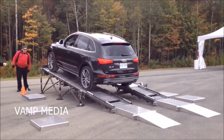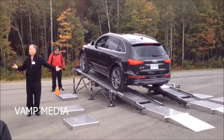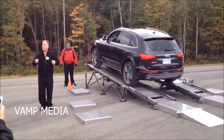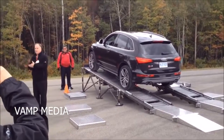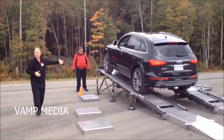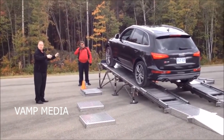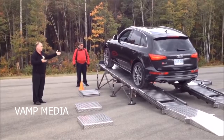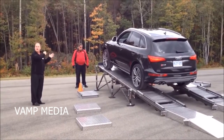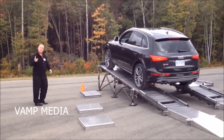Just walks it up. So the mechanical center locking diff, is it effective? Absolutely. And you saw the rear wheel had to do 3-4 spins, and we got lock up and we started walking the vehicle up, front wheel drive. So from a north-south, easy to walk, right? It's 40-60, but easy to go up to 70-85, and we can play with that all day long. Now let's make it more challenging.